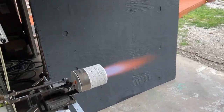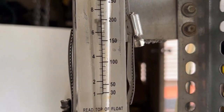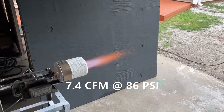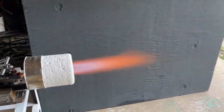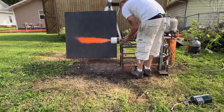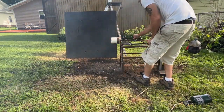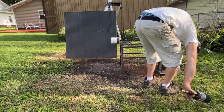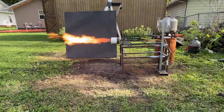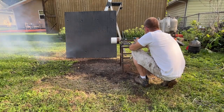Hey, what's up fellas. Last week we were taking a look at this burner — the Rhino refractory castable combustion chamber burner — and it was able to run at extremely high powers on propane. I said we'd take a look at it on waste oil, and when we did that I noticed some problems that weren't completely observable during the propane test. We are pumping too much air, so I tried making some adjustments, noticing that things just weren't optimal. The inlet port on the back of this burner is essentially just a bit too big.